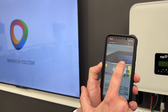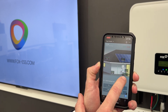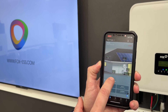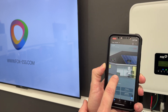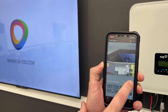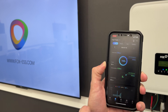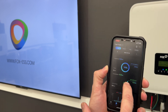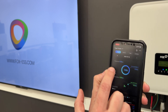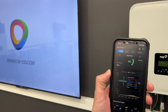In the app I can see exactly what my inverter is doing — from how much the PV is generating, to what my load is, to what my battery SOC is, to what I'm pulling from the grid. In this case I'm always pulling slightly from the grid just to ensure I've got some sort of signal from the grid to the inverter. I can then swipe across and see the full history of what's happened over however long I want to go back, and see all the stats in terms of what my inverter is doing.